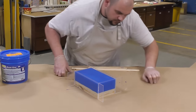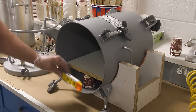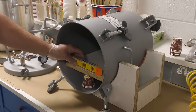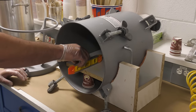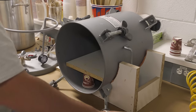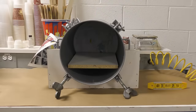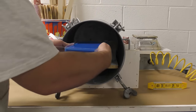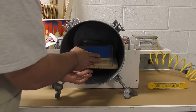After a quick visual check to make sure we have no leaks, the first half of our mold can go into the pressure pot to cure fully. In order to put the mold inside the pressure pot, we had to put the chamber on its side and put a leveling board in. This allowed me to fit a much larger mold inside the pot than would be possible if the pot was standing up on its wheels. This pressure pot is available through our distributors and comes with brackets to secure the pot on its side.